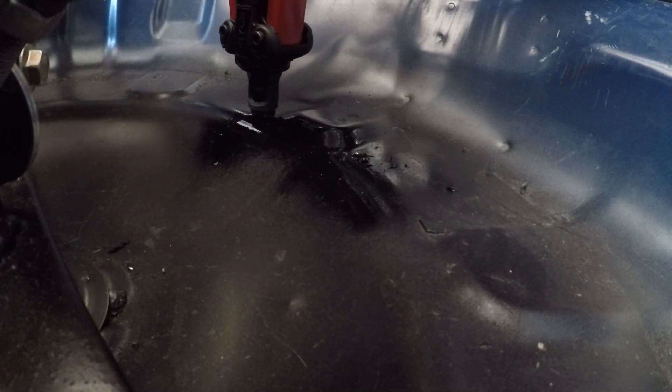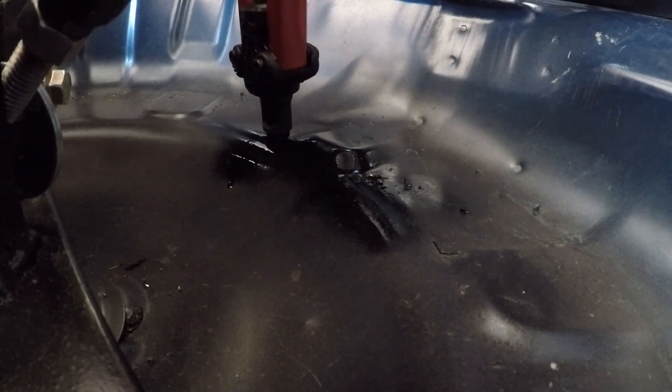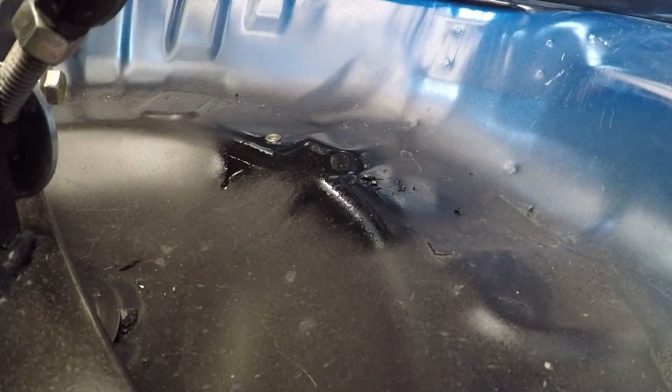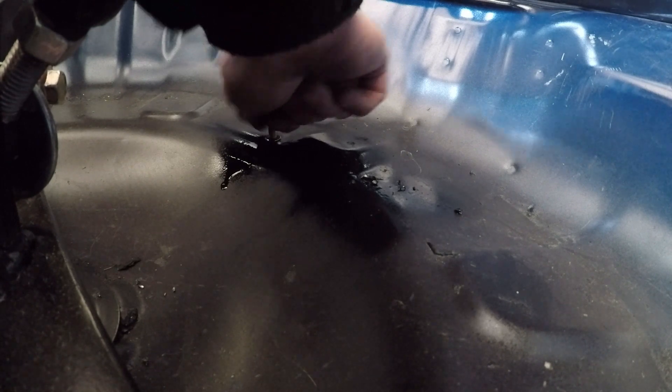Cleaning out the holes a little bit. Squeeze it tight, tighten it down — do this several times to make sure it's got a good crimp on it. Now what you've got there is basically a little threaded insert — a threaded insert — and you can thread in a bolt. What I'll do is have that bracket thread in from the bottom.